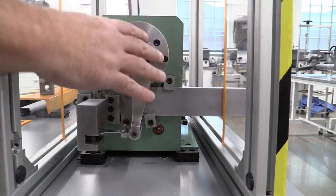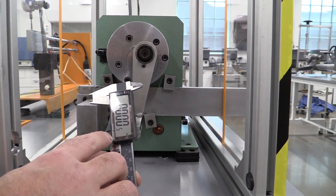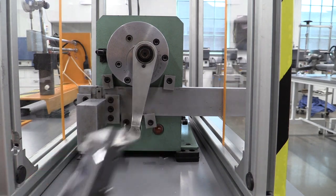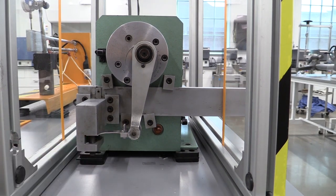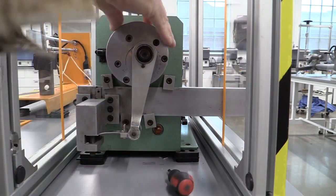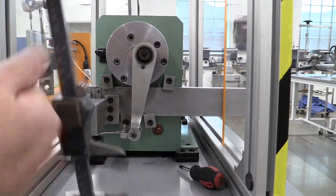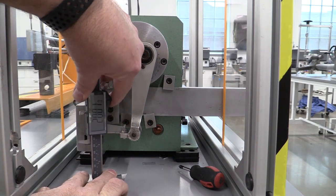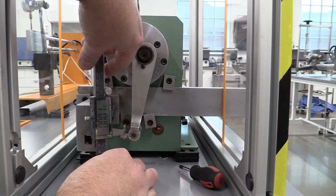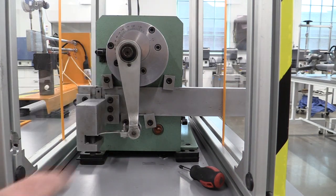We don't want to cycle this too many times, but you'll notice it's going to find the level spot right here. We have digital calipers, and a nice feature is that we can move it down, hit zero, and zero it off there — then measure any displacement. This helps avoid math errors. I'm going to measure the very back corner of the sample from the table, then cycle it to its maximum value and measure that same dimension. Your teammates will need to help. I'll zero that out, then measure the top of that stroke to get my value.